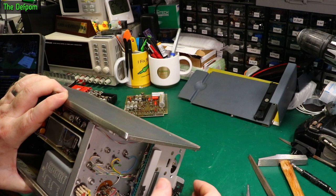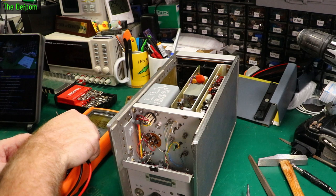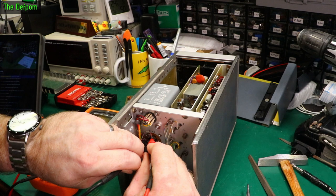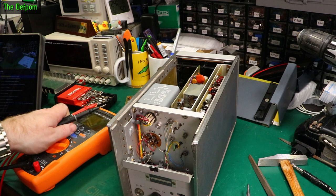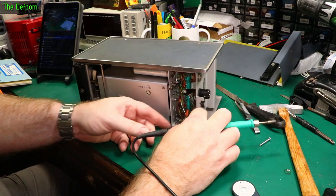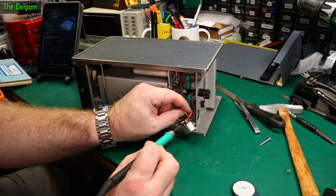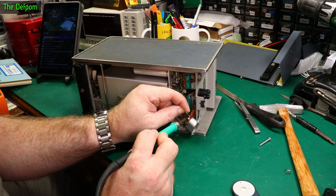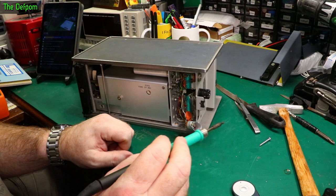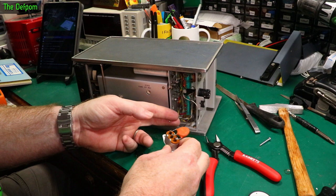There's a resistor in here — I might just measure that. This is one of these old carbon composite types and they do tend to go off value. I'm getting 246 ohms across there. Red, red and brown — so it should be 220 ohms. So it's gone high in value by about 10%. Probably right. I'll leave that alone. I'm going to take the wires off this connector — the one going to the fuse, the other is neutral, and the black one is obviously earth. I cut two of the wires because they've got plenty of length. The other one I actually desoldered with a bit more effort because it's only quite short anyway — I don't want to shorten it any further.